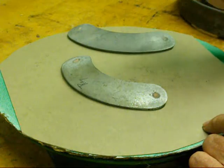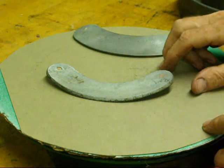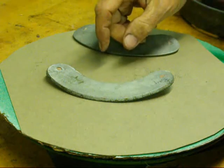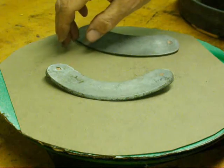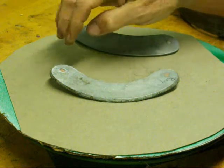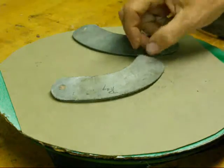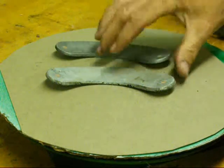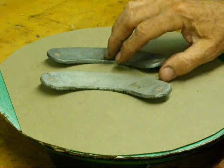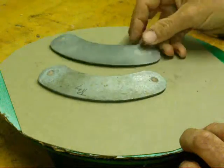I'm going to show you how to make a mold out of this so we can pour a couple of them. What you need to do is determine what the top and the bottom is. It's tapering this way — the draft is pointing up at an angle like this, so it's wider down here than what it is right at the top. When we make the mold, this is going to face up on the first side. If you have any holes you have to fill them temporarily with body putty, clay, or even sand — something that won't fall out on you. We'll do two of these at the same time. We're going to ram up the sand on one side and then when we turn the mold over we're going to take a spoon and part it down — we call that parting it down. That's the only thing that's really different than any other molds that we have made.